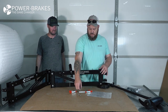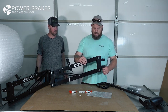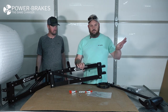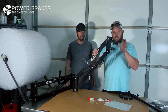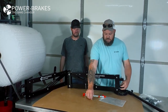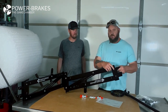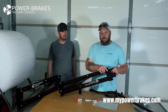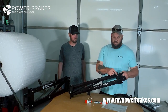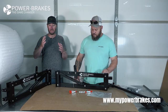Some of the other accessories: we give you extra cotter pins — you'll see them right here. This is the breakaway system. So if your motor is running and you're going pretty fast and you hit a stump, it'll shear these cotter pins off and the motor will pivot up. You just stow your brake again, fold it down, put new cotter pins in, and you're good to go. Some people don't want it to break away, so we supply two little stainless bolts, one for each side. But if you're running without a breakaway and you hit something really hard, something's going to break. So we send it with cotter keys by default — just for a little safety.